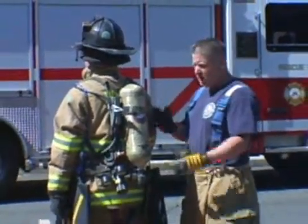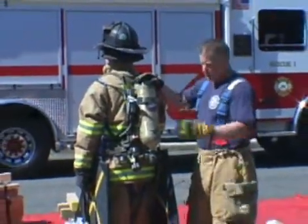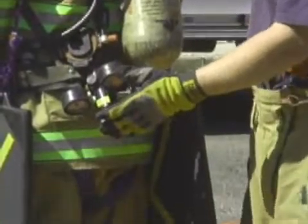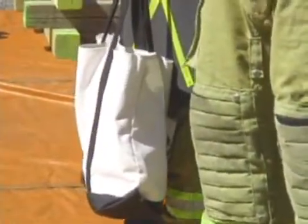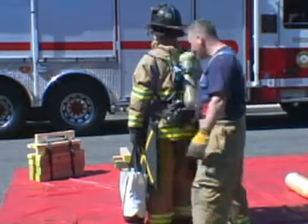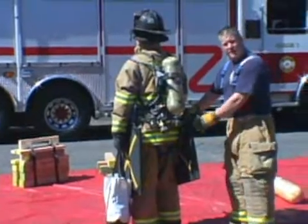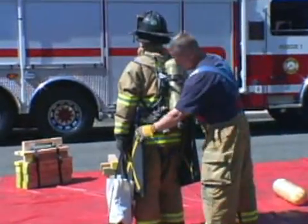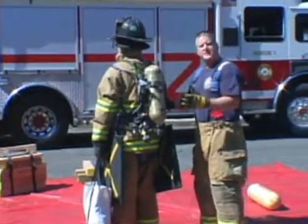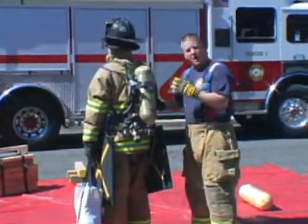As you can see, our airbag system is pre-rigged. We've converted an old SCBA and have the regulator already attached. We have a large satchel which contains our controller, our hoses, and our most widely used fittings. And our most commonly used airbags, the 20-ton airbag and the 15-ton airbag, have been supplied with carrying straps. So basically this system can be transported to the scene by one firefighter.